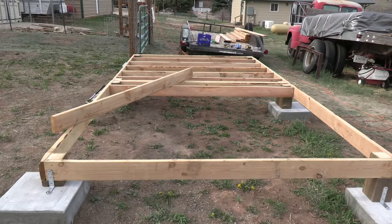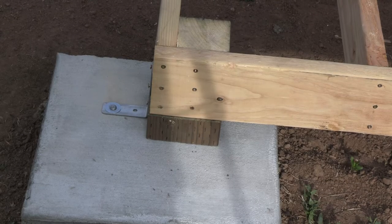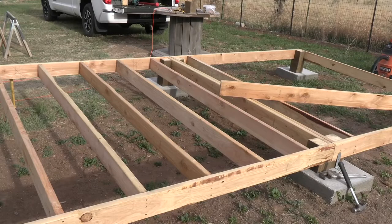After connecting the support columns to the floor frame, I used my 100-foot tape to square the frame by pulling it diagonal corner to corner and adjusting the frame to the exact measurement. So now I have the floor level, supported, and square. I made a connection at all 4 corners so it can't shift, and now I'm putting in the floor joists.